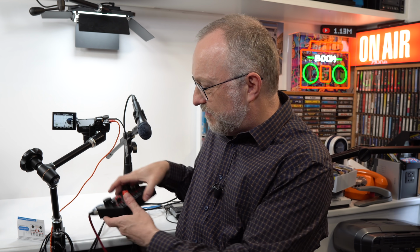Now, as far as the mics go, I went around the house trying all different mics, different cables and things, because there was just no audio coming through it when I plugged in a proper 6.3mm mic. It worked all right with this lavalier, but again, that clipping was just too bad on this. It just sounded terrible. Sounds better with this mic, but I found out, this is just a good demonstration of how bad this thing is, that when the mic is plugged in here, it won't make any sound at all until you plug another thing into the 3.5mm socket here that's labelled capacitor mic.